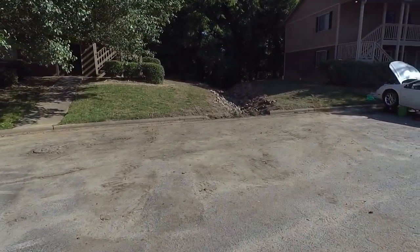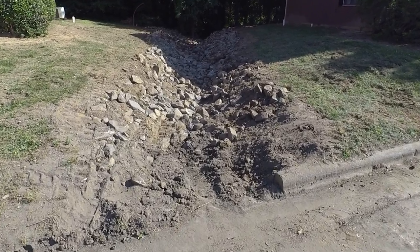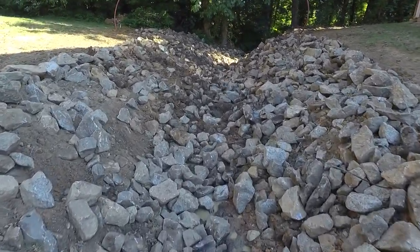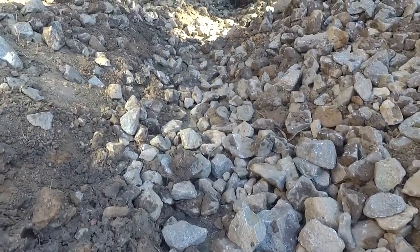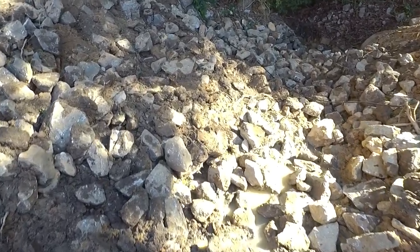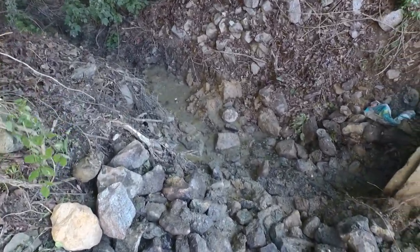We are finished with the first part of this job - this is item one of five. Here's our new swale. We had five dump trucks of dirt and mud and muck that came out of here. We dug it down quite a bit and put the riprap back in there. There's a ton of water in here too. This will eventually fill in and make itself a little channel here. You can see all the riprap's all muddy - we need a good rain to get this washed in a little bit. But the point is it's now flowing like mad. None of this was flowing earlier today.